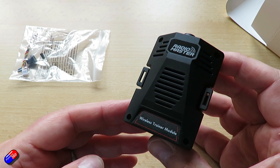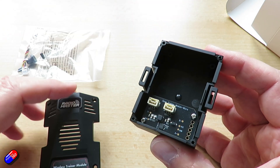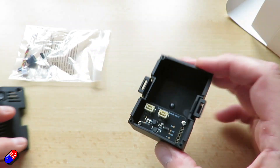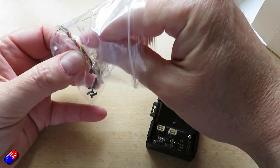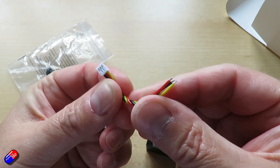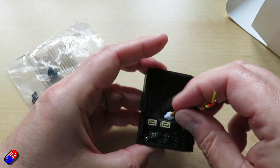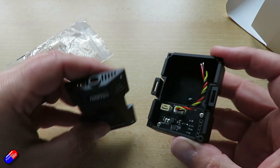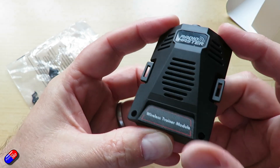If you have a buddy or another radio that has receivers that talk SBUS, you can use it with this. What's actually inside, if I take the top off, is a little PCB board here with a couple of connections and a little cable. The little cable is designed to be soldered onto the SBUS receiver from the other radio. The wires are exactly as you'd expect: five volts, ground, and SBUS. You plug it into the little output, put the SBUS receiver in here, stick the antenna out the top, and put this all together and stick it in the back of your radio.